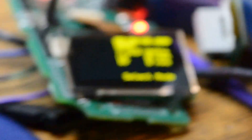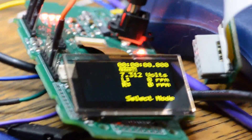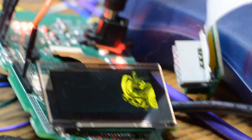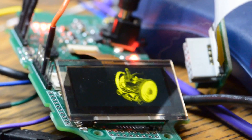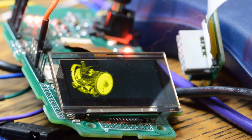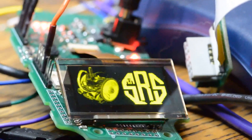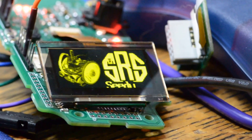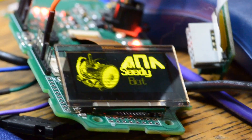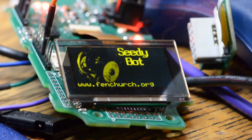I'm using kind of a weird lens here on this camera for video, so you'll have to excuse all the out-of-focusness. From a distance you can see what that looks like. This is 128 by 64 pixels, 4 bits per pixel, so it allows you to write 2 pixels per byte on the SPI bus.